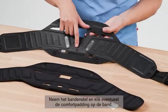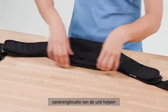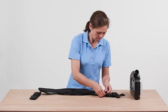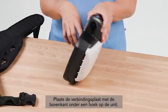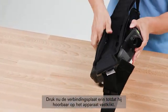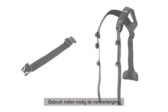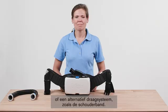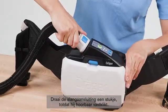Take the harness and button the comfort pad onto the strap if needed. To connect the carrying system to the unit, the markings on the connecting plate and at the receiving location of the unit will help you. Position the connecting plate with the top edge at an angle onto the unit — the markings must each match. Now push in the connecting plate until it audibly clicks into place. If necessary, use the strap extension or an alternative carrying system such as the shoulder strap. To connect the breathing hose, plug the hose connector onto the coupling of the device and slightly turn until it audibly clicks into place.